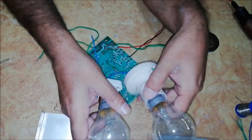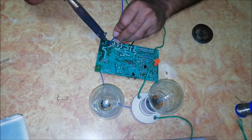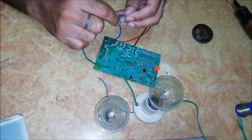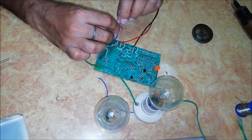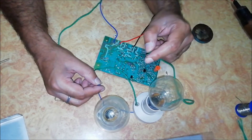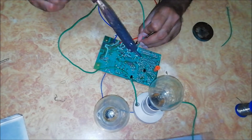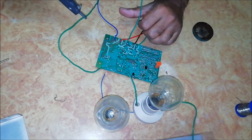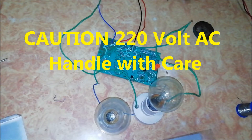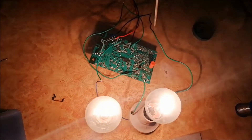Instead of the motor, I have connected a 200W bulb to the circuit. This is the output of the TRIAC. I have connected the common point of this bulb to this TRIAC. The other two wires are connected separately to both relays. Now give 220V AC to this board. To start the board, we have to connect the common pin to the VASP pin directly.